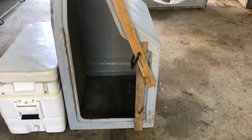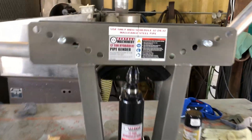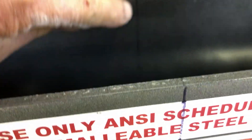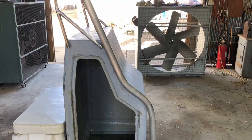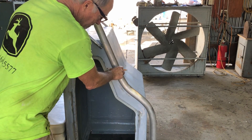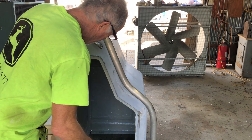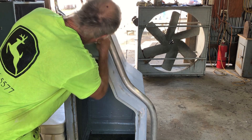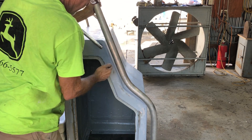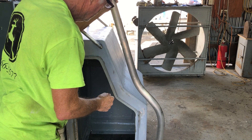I changed my little wooden template for the second angle and got the pipe flipped upside down in the bender. I got a measurement and a mark on the pipe and lined it up with the center of the bender, so I'm going to bend - I just have to make sure I don't go too far. This took quite a few tries in and out of the bender because I didn't want to over-bend it, so I kept taking it out and checking it, but I got it now.